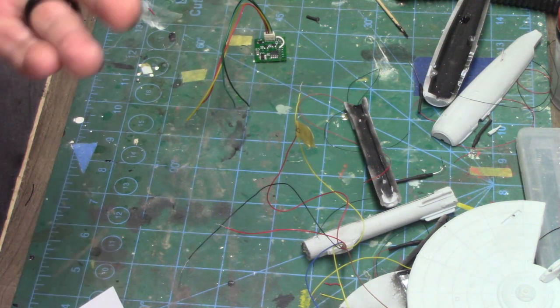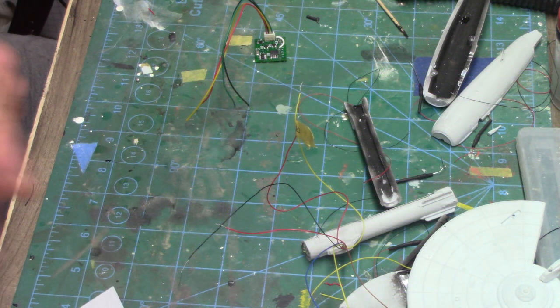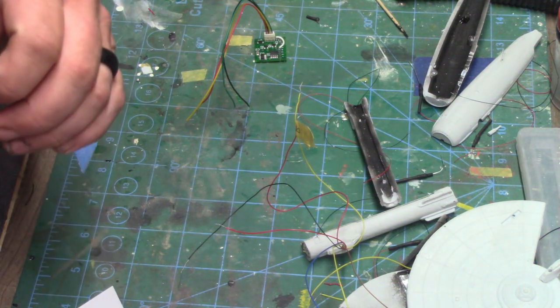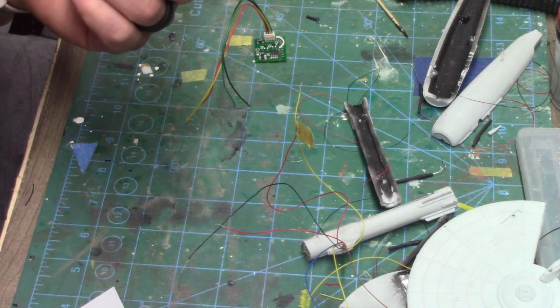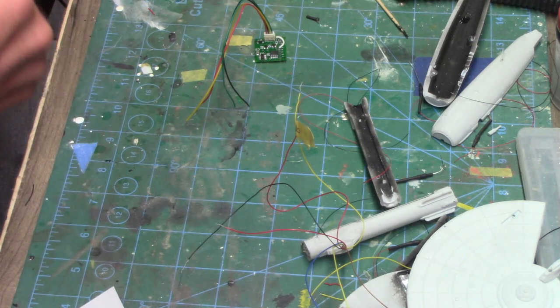As I said, this board has 4 timings already pre-programmed, which is great. It does have an output capable of driving 200 LEDs. This is accomplished by using a series resistor for each LED to limit the current to 10 milliamps per LED. Or if you have a custom application that uses 1 to 2 amperes, the transistors will handle it. As always, there is a 5-year warranty.